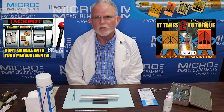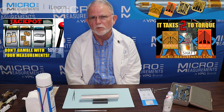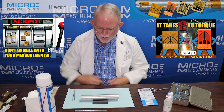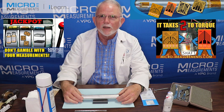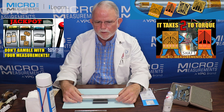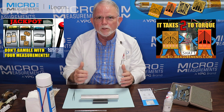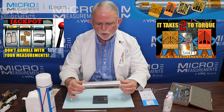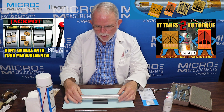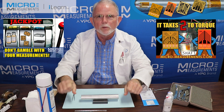Hello, my name is Tom Rummage. I'm a Senior Applications Engineer here at Micro Measurements, and today we're going to talk about torque. Someone has told you that they need to feed their finite element model with the amount of torque going through a particular shaft or part, so they can develop their model more thoroughly and accurately. We're going to take this aluminum tube, bond a 250 USA gauge onto it, and wire it up to measure the shear strain or torque based on a torsional input.